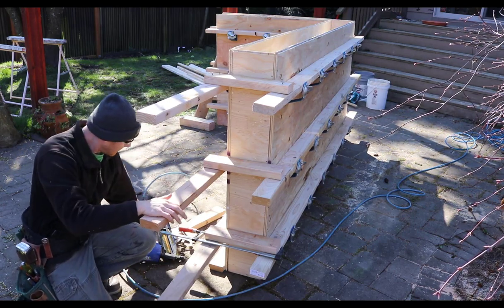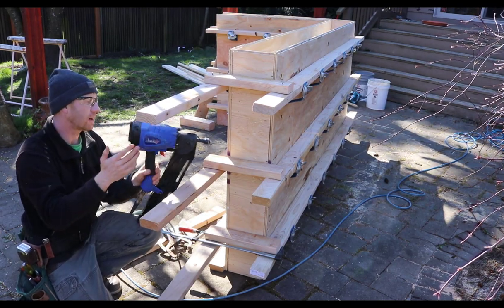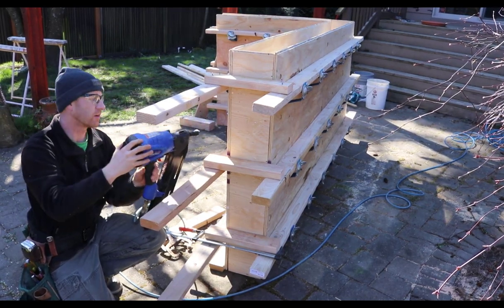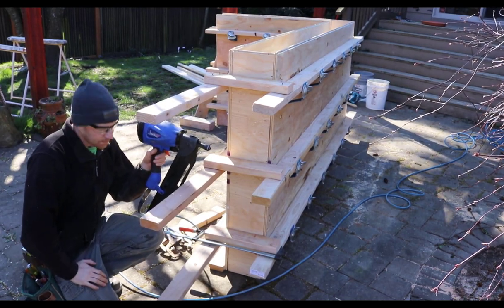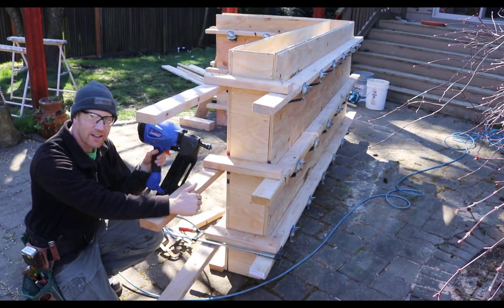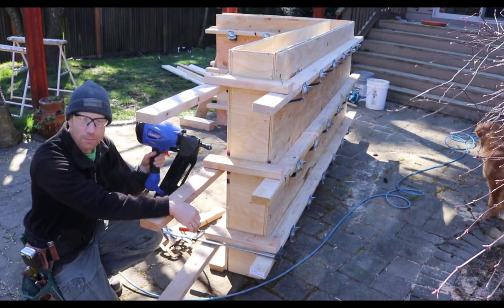So we're going to try out this guy here. This is a nail gun, Nail Pro. I think the company itself is actually Jacko or Jayco. I'll get it right, and I'll do a review on this a little bit here. But it fires 16 penny and 8 penny duplex headed nails, and it also fires regular round head conventional framing nails. So it does a couple different purposes.